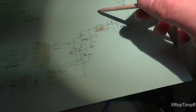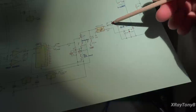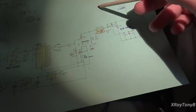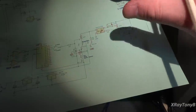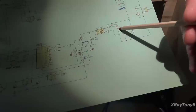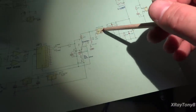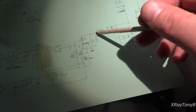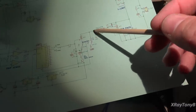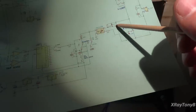If you turn these on in the middle of a half cycle — which is just a matter of luck whenever you hit the power switch or reset — without zero-cross detecting you could be at the peak of a half cycle, which would be 160 to 170 volts on 120-volt mains. That could be a very large amount of surge current, which could stress these SCR devices, especially if you had a smaller triac in there. So this is a very special optocoupler. You can get the same chip without zero-crossing detection, but it will not control when it turns on.